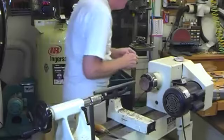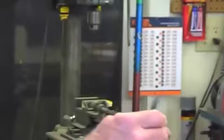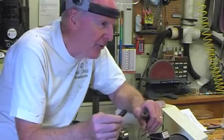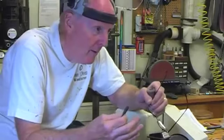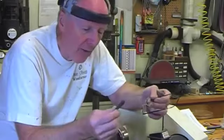So, another little piece of equipment: these are the non-woven pads that you can buy, 6-inch by 9-inch non-woven pads, and the black is similar to 4-aught steel wool, and you actually buff the wood with it before you put any finish on it. And actually buffing the wood before you put a finish on it will show up scratches, and then you can sand it. And this provides a sort of non-slip surface here, hopefully.